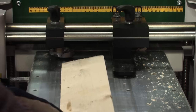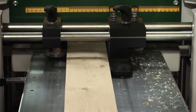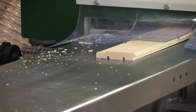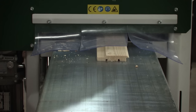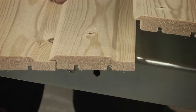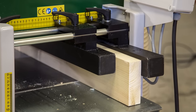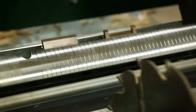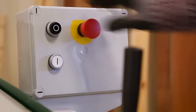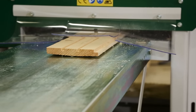When making the front side of panelling, the heartward side of the workpiece should always be facing upwards. Also, a relatively simple moulding can be nice to look at. With the optional attachment for making tongue and groove profiles, you further increase the range of uses of this planer. First, you machine the board on one side, then on the other.